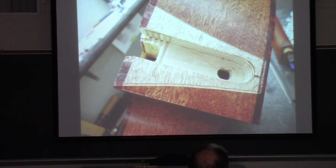Okay, I was talking about that little part that needs to be removed because it can interfere with the movement. Basically, the tenon is going to get pushed in. When you're resetting the neck, obviously the tenon is going in deeper this way. And if you look, you can see this little secondary route right there. That has to be chiseled out. Not quite so much here because you're really not removing any wood there, but you're removing wood down in this area here. So you just want to get in there and hog that out.